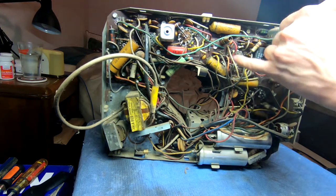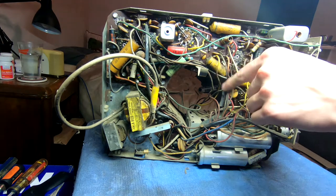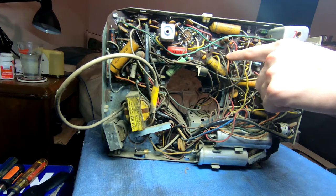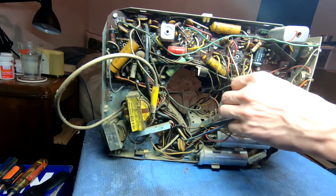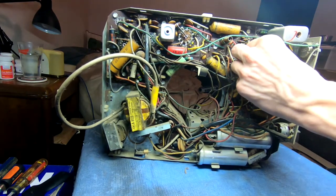You just have a point, and then you have a wire wrap gun. Wire wrap is great, but over time, that connection's probably going to oxidize, and I'd prefer to solder it and just make it a little bit better. Although, from what I understand from the aircraft industry, a lot of places prefer this attachment versus a solder joint, because solder joints, if they vibrate, they actually work harden and snap off. But when you're dealing with solid core wire like this, honestly the same is going to be true whether you solder it or not. Either way, not important. We do have, let's see, that's a 0.05.